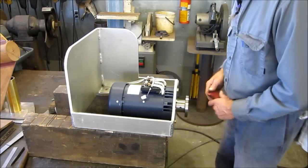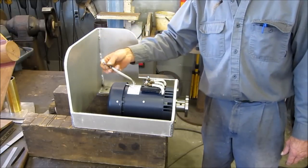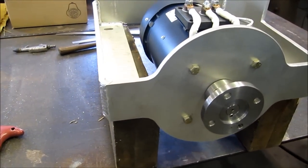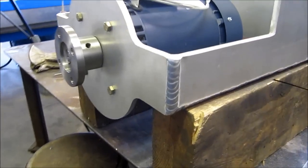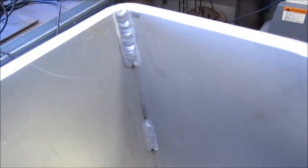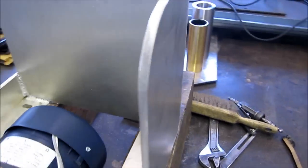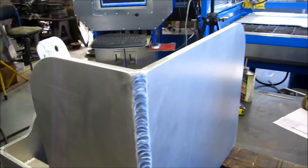All right, there's the coupling — nice, nice. And there's an inboard — first electric-powered one I've ever seen. There's a little black soot in the corner there, but at least I didn't have a bad weld, just a little coloration. I only put a little bit of inside weld just to strengthen the corners. This hundred percent wall penetration and bead along the entire outside is more than enough.